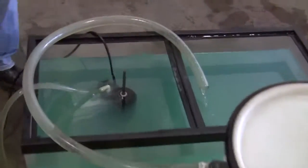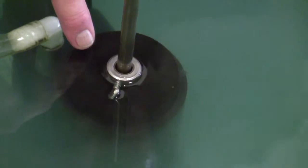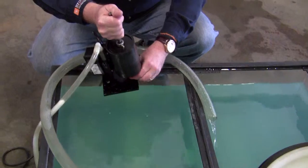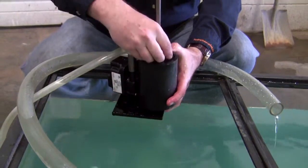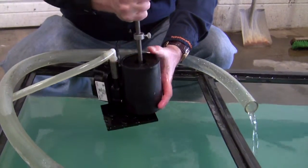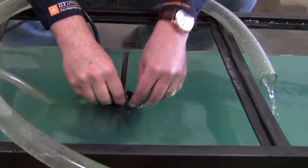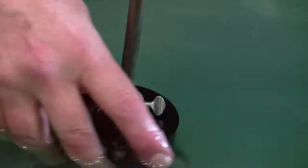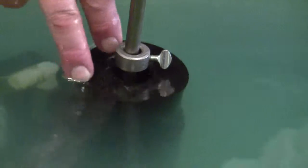Right now this skimmer is below the surface of the liquid, so it's set too low — it can't get enough fluid. To adjust this, you move these collars up and down as needed. It's best to get it down as far as you can to have the maximum floating ability of the skimmer. What you don't want is to allow the bottom end to come out of the base, otherwise it's not going to direct the flow down in like it needs to.